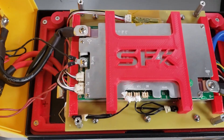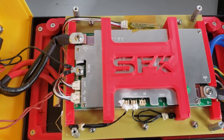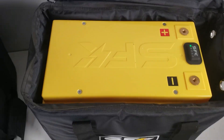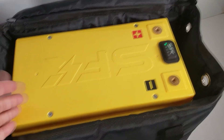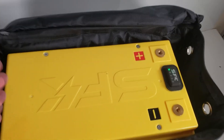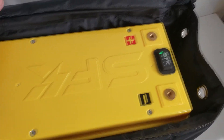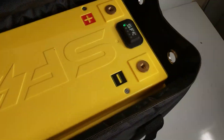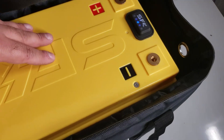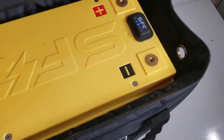What this added switch gives you is basically an all-in-one solution without having to buy the heated battery jacket. You just use the built-in heaters of your SFK300HP. As you can see, we have our SFK300HP battery inside our kit case, and we have the internal heating pads running even though we're not charging. If it's cold outside, your battery would be keeping itself nice and warm, and the standard insulated jacket would be enough since you already have heating elements within your battery.